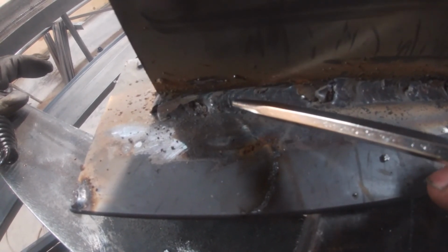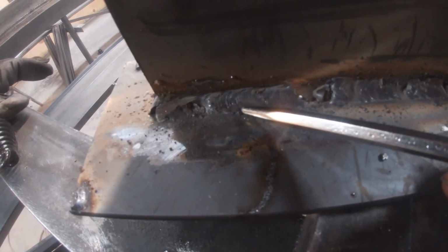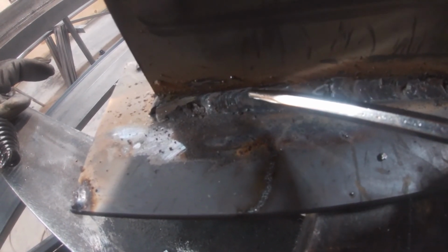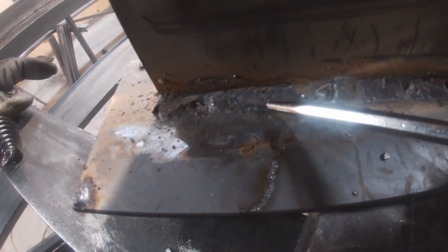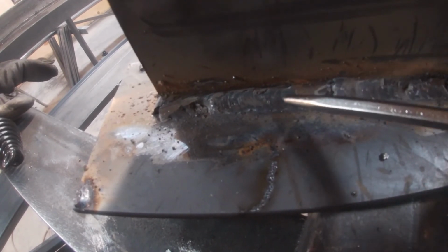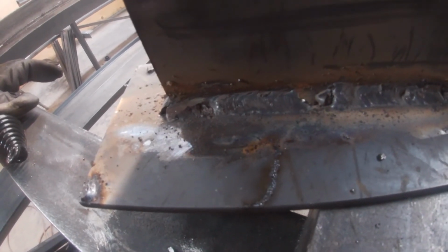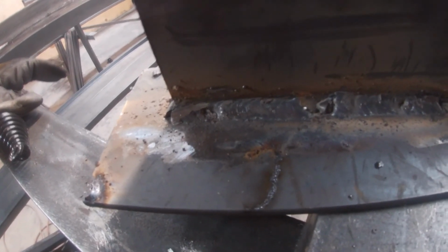And that's all the stick welding is. It's just almost like L's. And I MIG weld very similar. The only difference is with MIG welding, I push so that my gas envelope stays in front. And with stick welding, I pull. All right, I'm going to turn this piece around so that you can see the two other types of welding that we did today.